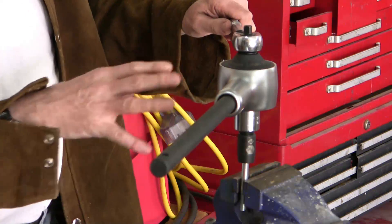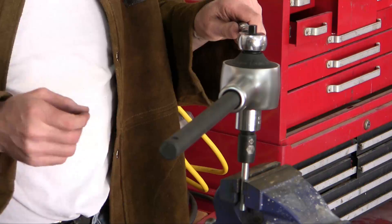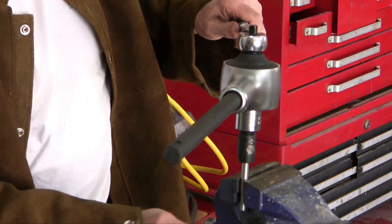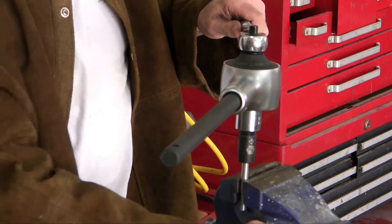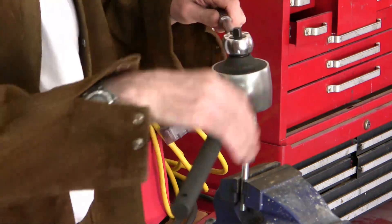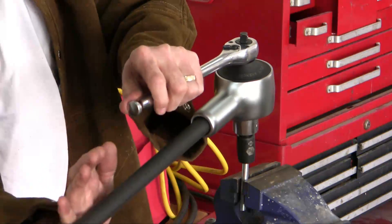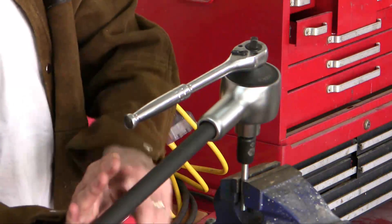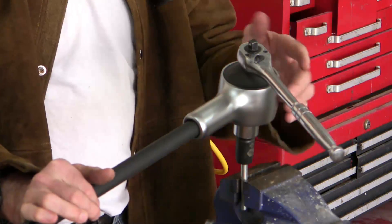So what you need to do is somehow freeze this bar so that it can't turn in the opposite direction. There are two forms of torque multipliers: the kind specifically designed for commonly used applications like truck wheels, which have a brace that slides against the hub of the vehicle and against one of the bolts — and then there's a more general kind, which is this kind. You have to put some kind of blocking device in here to block the movement of this bar so that the torque is converted to torque on the bolt.